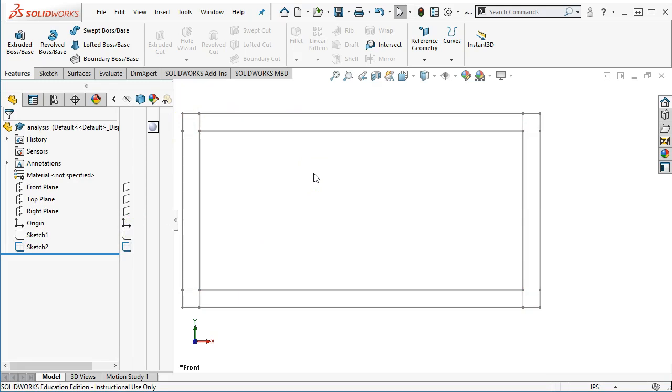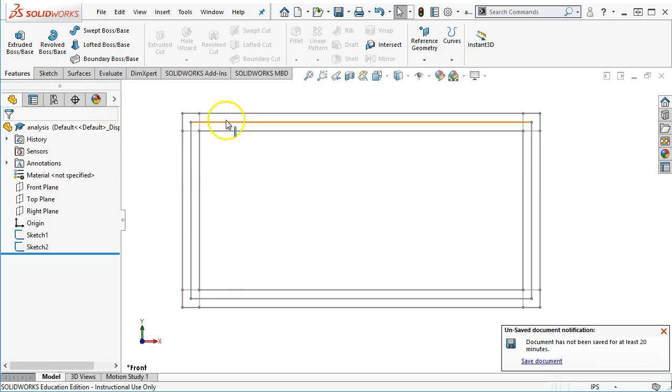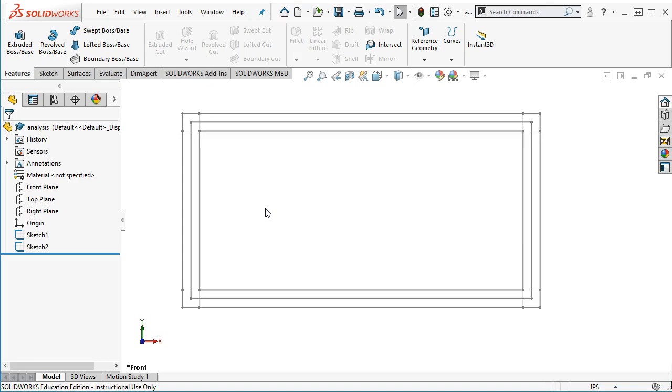So where we tried to do the plus or minus 5 or the plus or minus 2 to begin with, this is magnified by 10 times now. All right, so I gave it a tolerance zone of plus or minus 50. And as we start to shrink that tolerance zone, what I'm hoping to see is that some of those values are going to get tighter and tighter on the controls, but are also going to be determined by the manufacturability